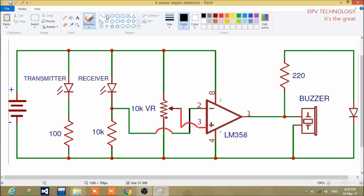In open loop connection, if we give a voltage to the negative terminal — that is pin number two of the IC — and if we connect pin three to ground, we are applying a voltage at the inverting terminal which is greater than the voltage at the non-inverting terminal. Since pin three is connected to ground and pin two is connected to, let's say, plus two volts, then the op-amp gives an output equal to the applied voltage but with a negative sign. That is, if we apply plus nine volts here, it will give approximately minus nine volts.